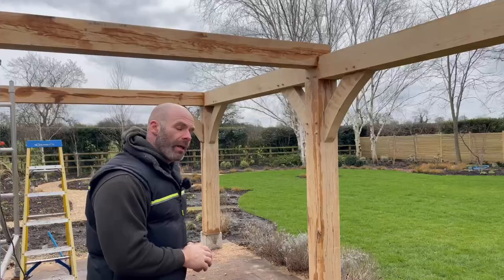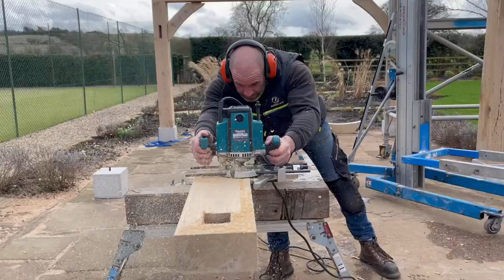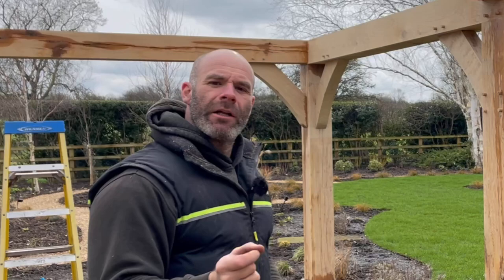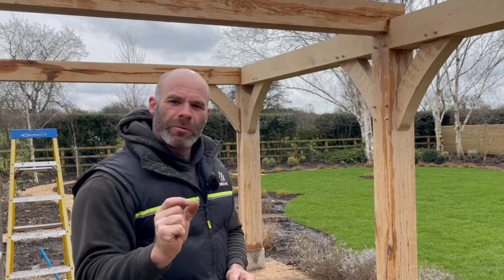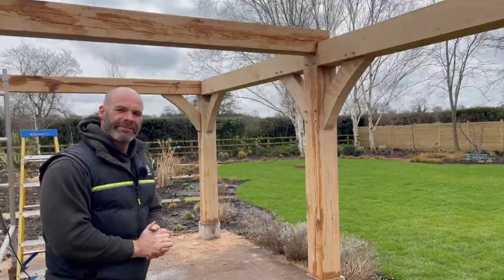There was one other process we put the wall plates through before lifting them into place — routing a groove in the top. You can't see it; it's out of sight, which is on purpose. What we've learned is that a lot of clients like to have an LED strip installed to up-light the ceiling. If you don't put a groove in, you can just see those LEDs, so we like to look after the electrician and put a groove in to suit that LED strip. It's wide enough to suit either just the strip or, ideally, a diffuser, and it looks extremely good.